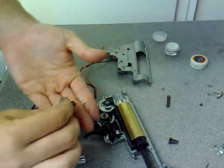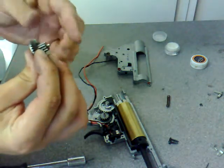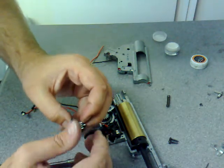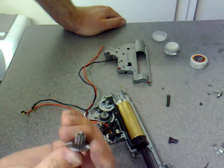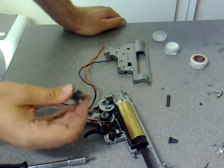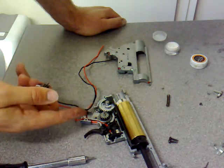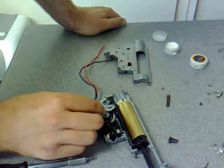I haven't really had a problem with too tight on these, but I have had a problem with too loose, where obviously if only a small portion of the pinion is touching, it's going to wear quite quickly — either the bevel gear or the pinion gear. So I'll go with quite a small one here, I think this is like a 0.1, as small as you can get. Obviously it varies because of the different heights of the bearings and different heights of bushings, and how thick they were made.